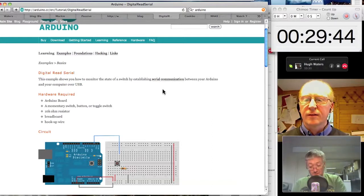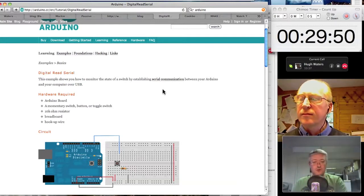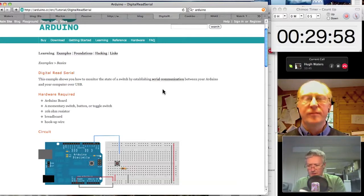But from a programming point of view, they're the same port, and it can be powered either over the USB interface. So when you plug it into a computer, it powers up and you can then dump code into it or interrogate it. Or it's also got a little 5-volt input jack there. And in fact, you can get to the pins on the board to power it, just by soldering onto the board.